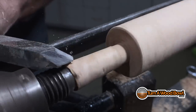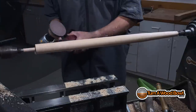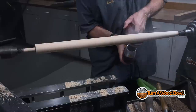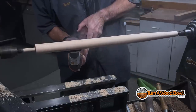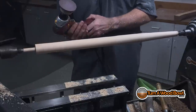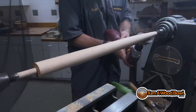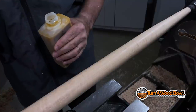There you can see the slicing cut up close — just taking off very thin layers. We want to work right up to the desired thickness without making excessive cuts. There's the main handle: on the right is the tapered portion that goes into the shovel, and on the left is the tenon that will hold the handle itself. I was thinking about attaching the green plastic handle, then thought — nah, I don't want plastic. I'm going to make a wooden handle for the top, which is why I created that tenon. Now I'm going to sand this through all the grits — 120, 180, 240, and then 320.